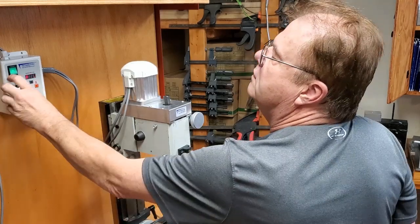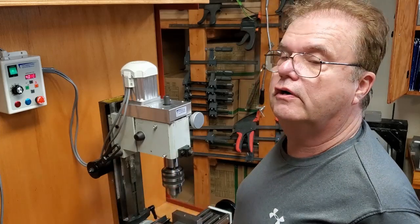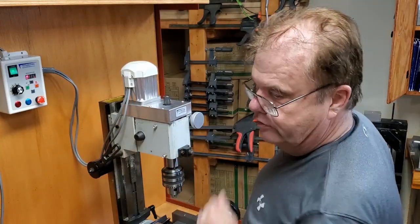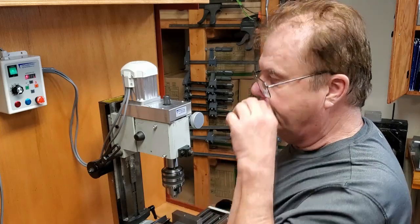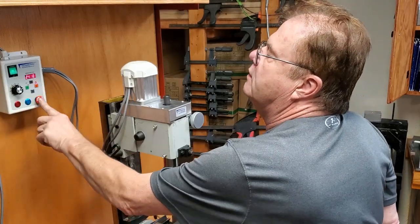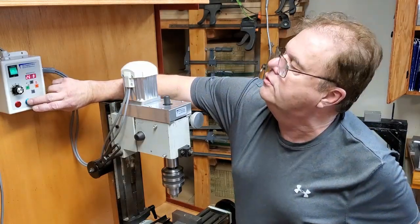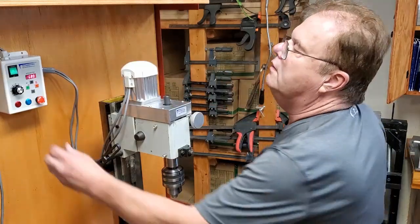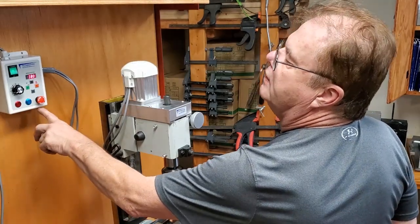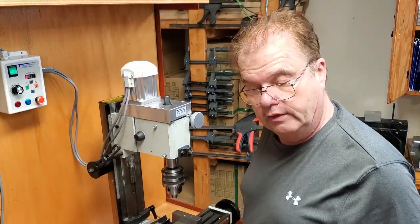Select that. Now it'll run to 4000 RPM. I just picked up an extra 100 RPM by setting the stop point just above what this motor really wants to do — you might pick up another hundred that way. If you try to run it faster than it wants to, it's not going to. E-stop works. You may want to label these buttons with your own labels — I don't have them at this point. That's it, the kit is done, it's built and ready to go.